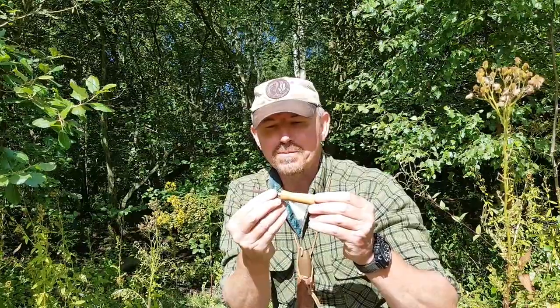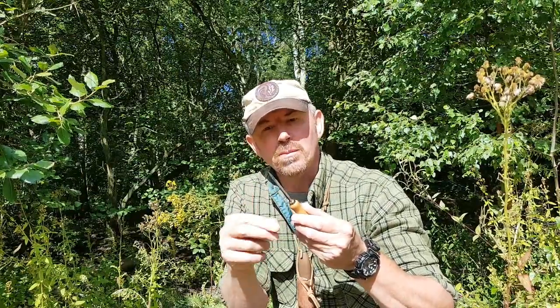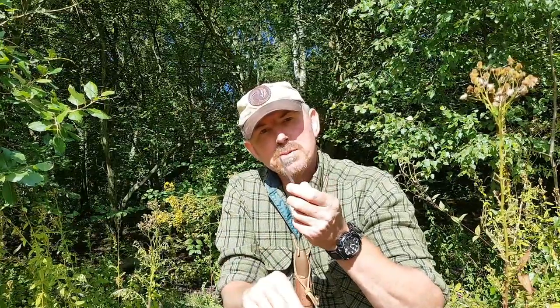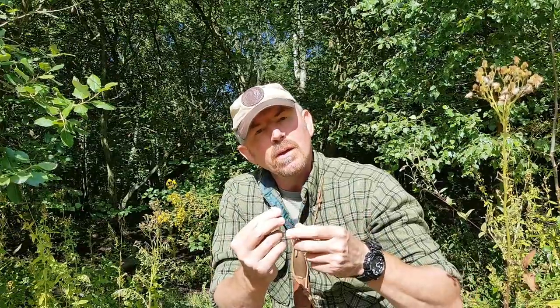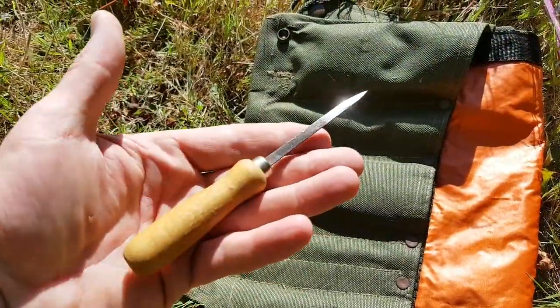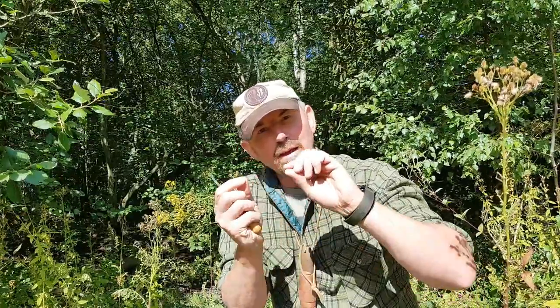This is a little three-sided awl. It's an old silversmith's file, again from my little tool shop. All I did with this was put it in the fire to re-temper it, and then using my sharpening stone I sharpened the end. What this allows me to do is, because it's got three sides — three cutting edges — when I bore a hole in something and I twist it, it actually cuts a hole. If I'm working with bark, when you push a hole through it, if you don't cut the hole, you'll get a linear split start to form. With this it prevents that from happening.